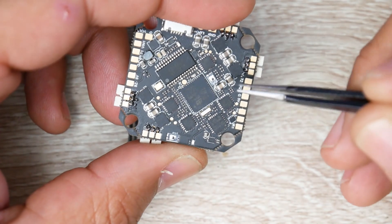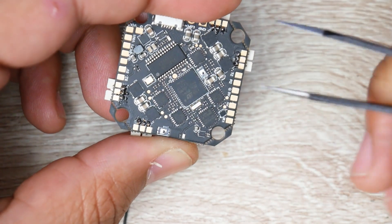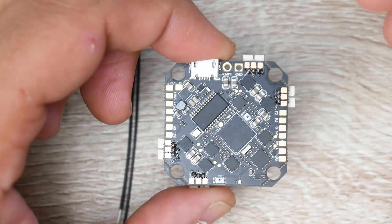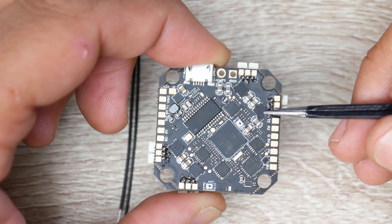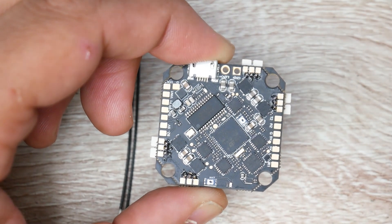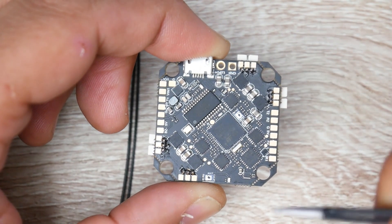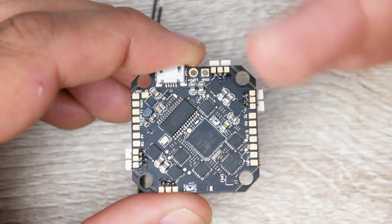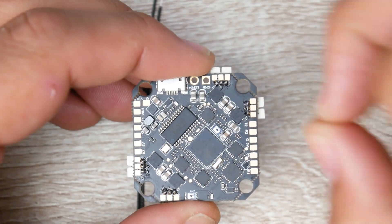Some all-in-one boards give two dedicated MOSFETs for each phase, but other boards combine two MOSFETs into one dual-channel FET — and that's what this board is doing. It's always better to have two dedicated FETs per phase, especially on a power-hungry setup or a small toothpick. This board uses a single dual-channel FET per phase — two FETs are built into one. The heat dissipation and overall current delivery will be slightly less than with two separate dedicated FETs per phase.